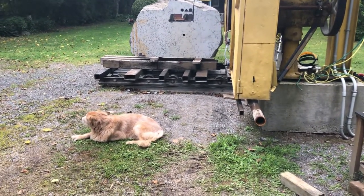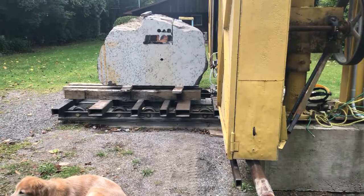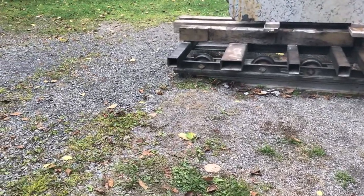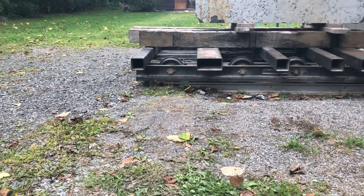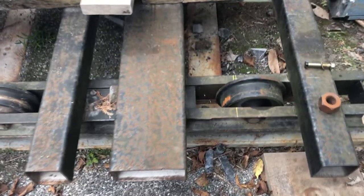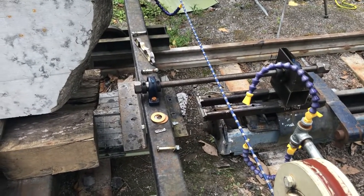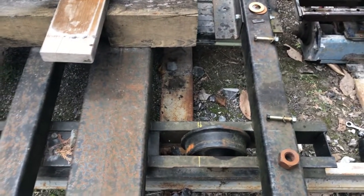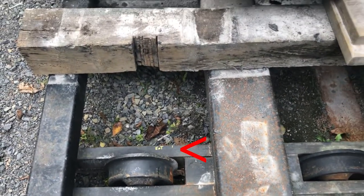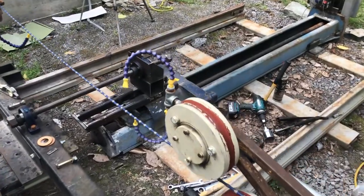This is the angle I come in on with the forklift. Now you can see it's extended out and I can get the stone in there, and that last wheel is still on the track. I've marked a yellow line representing where the wire is when it's fully retracted. As long as I get the stone between that yellow line and this little line here, I can go all the way through it — that's about 69 and a half inches of travel.